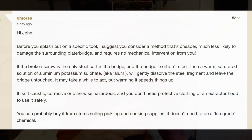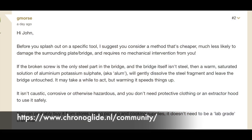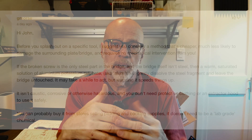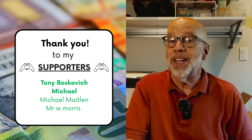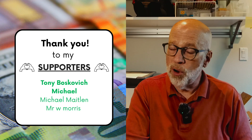Second choice: soak the plate in alum. I got this suggestion from a user in the Chrono Glide forum. The alum will dissolve the steel but not the aluminum base plate, and it's not caustic like sulfuric acid, so that's good. But you'd better be certain there's no other steel on the plate, or you're going to get a nasty surprise.